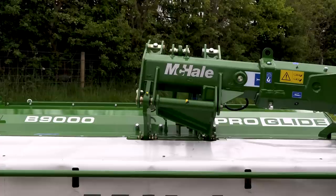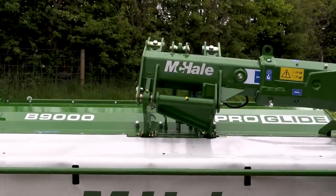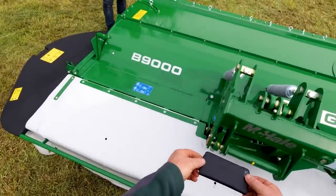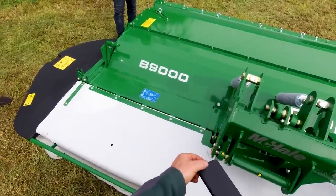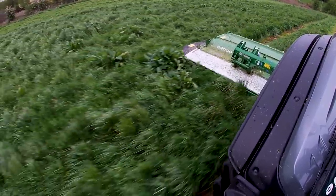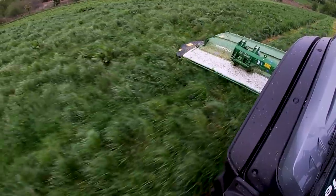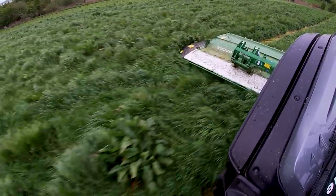If we look at the design of the mower here, where it pivots and carries, it's a pull-type system. The mower has loads and loads of flotation. When it's working, it can go forward to back, left to right, and it can also move laterally. You've got a huge amount of movement in the bed of the mower. The beauty of that is it floats independent of the movement of the tractor, so it contours the ground at all times and you get a perfectly even cut.